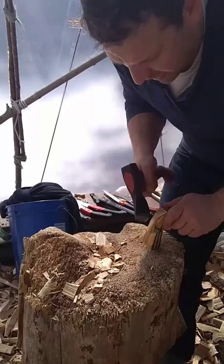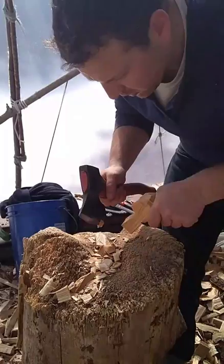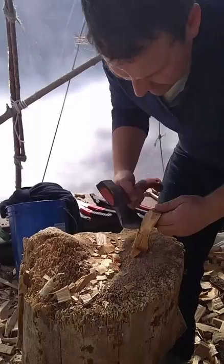because you never quite know how much depth you're going to be able to achieve on a scoop. Depends on how well the wood's behaving itself, how sharp your knife is, what the radius of your knife is versus the radius of the bowl of the scoop that you're trying to carve. So, good rule of thumb is give yourself a little extra cushion on scoops. They're so small that it's pretty easy to carve down the extra with a knife.